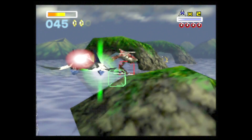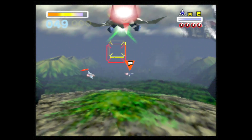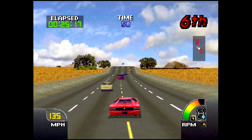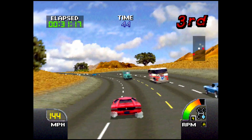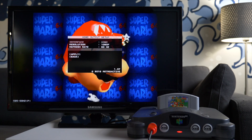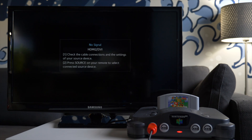In normal operation, it has about a 1 frame delay, which really isn't noticeable. But the module's processing can be turned off to eliminate this, though doing so limits you to 480p or 576p. And due to the N64's non-standard refresh rate, there might be screen tearing every few seconds. But there's also a mode that passes the signal through as-is with no lag or tearing, the caveat being that not all displays can handle it.